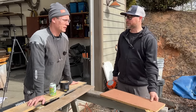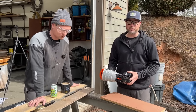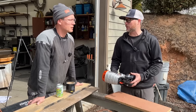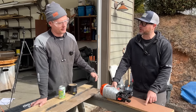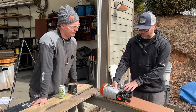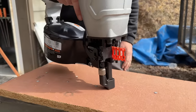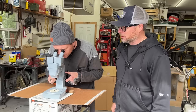That's way faster than screwing, and I like that it's a coil so you have a lot more fasteners. We've nailed down floors with ring-shank eights before and you just go through a lot of nail clips. I wonder if these are stiffer to drive. I think this is going to outperform both our nailer and our screwing technique for putting down subflooring.